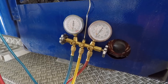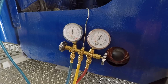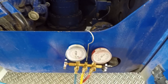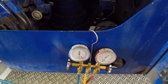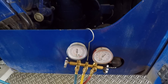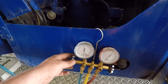I've been around this stuff for years. I've been a heavy equipment mechanic since 1998 — I was tinkering with engines even in middle school. Over the years I've learned enough about HVAC systems to be confident and to give you guys some advice. Cans connected: never open the red high-pressure valve. All your charging goes in the blue low-pressure side — that's the only valve you'll mess with when you have a can connected.